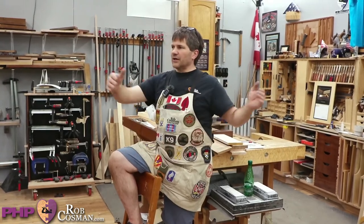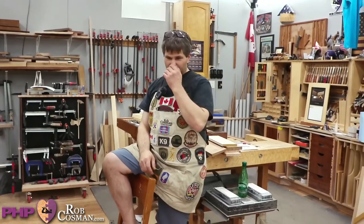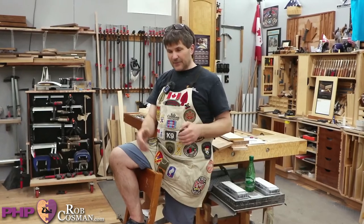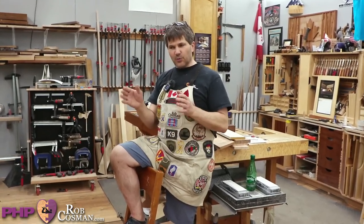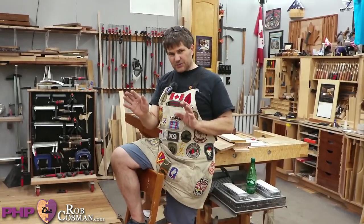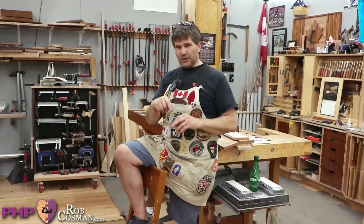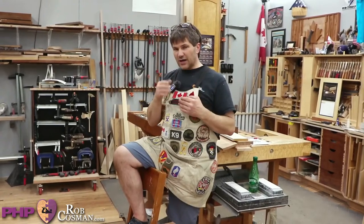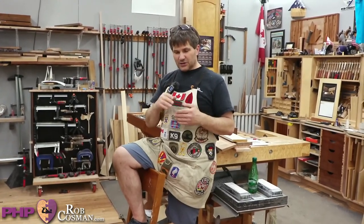And over a 10-foot board, the grain may change direction numerous times. So what I preferred to do was to hand plane each board independently. I knew that this board was best planed right to left, and I would label it as such, so the top surface would be smooth. Then I would do the next board. So when I glued them together, I had already determined which direction was best to plane, so all of my planing could be done in that same direction.